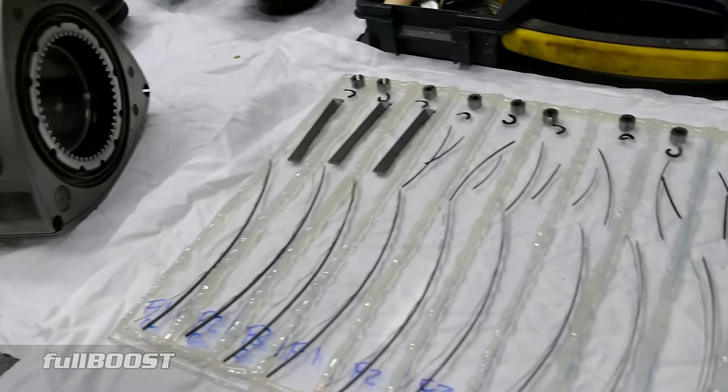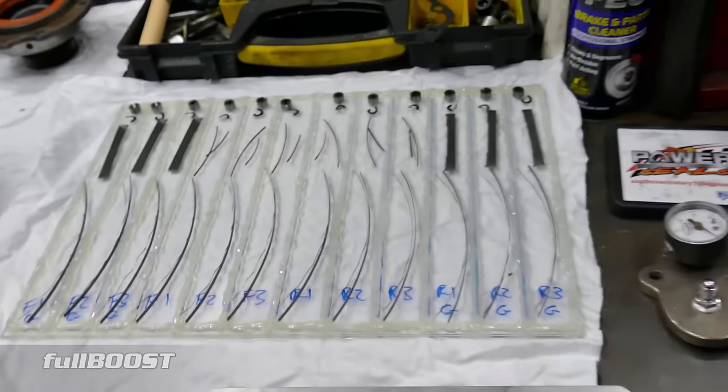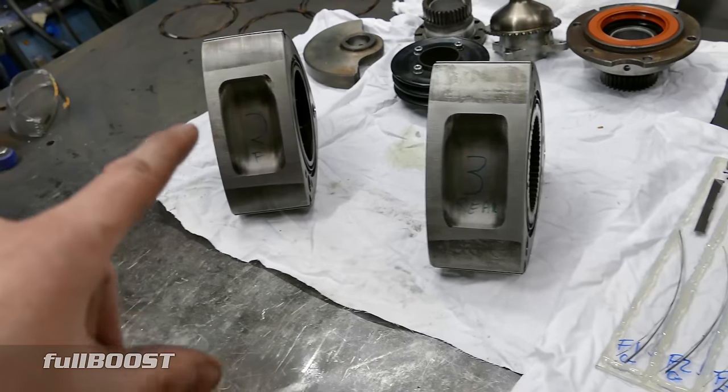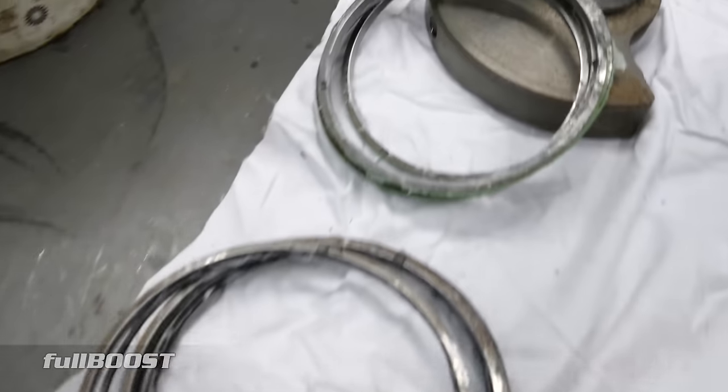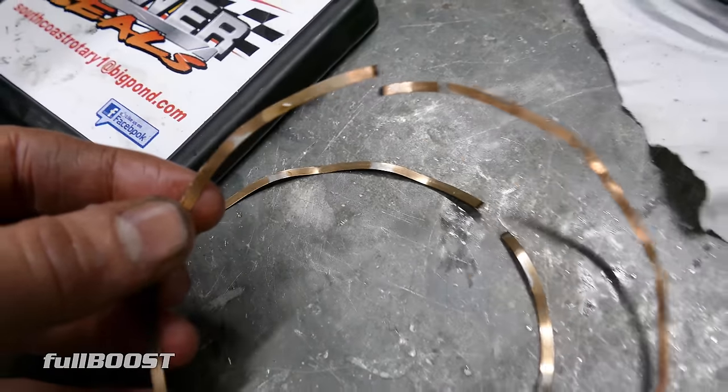This is how I do it — set it all out, then it's time to assemble everything. Time to get the massive tub of Vaseline. After oil control O-rings are installed, it's time to install the springs first. You may or may not have colour paint on your oil control springs — you may have white and blue. If you do have white and blue, new springs make it easier to install. White goes to the front of the rotor, not the gear side.